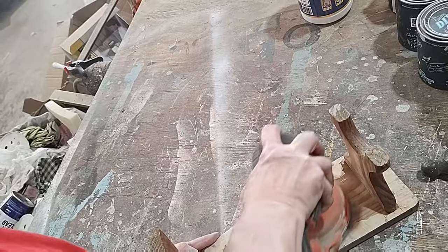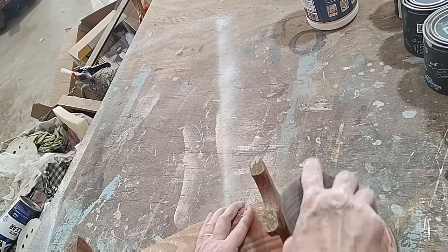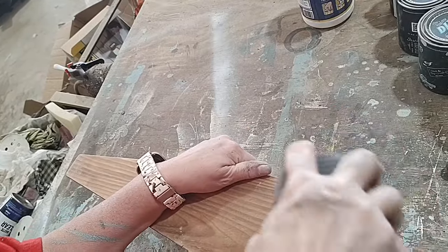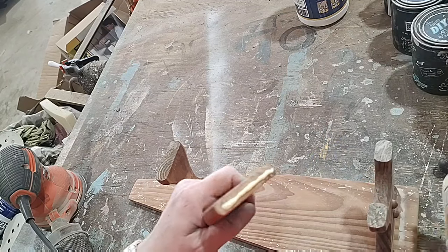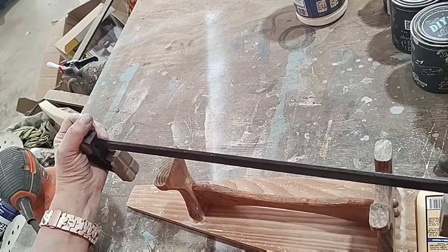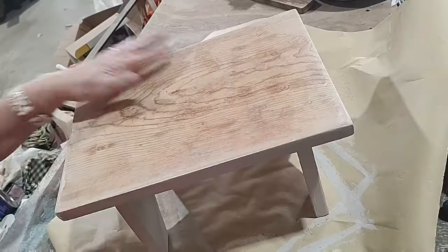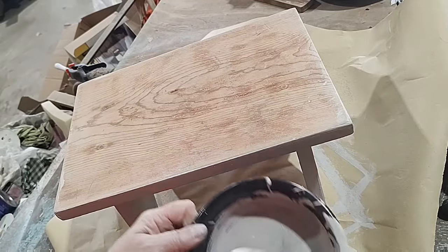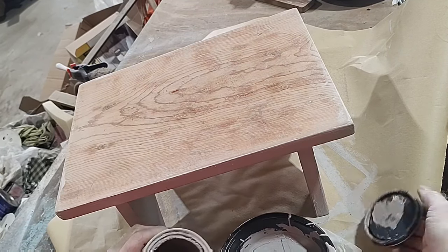This is completely dry now. We're hopping in while other things are drying — that's really what it's like in the shop, moving between pieces. The plastic wood worked really well, very smooth. I decided not to try to screw the cross piece back in because the little faux screw covers were attached so well I would have broken them to remove them. Since this is a decorative piece, wood glue is plenty to hold that back in. Here's our very first piece — I did sand smooth around the edges where the paint had run down, and I'm only going to use one coat of Faded Burlap on the top.